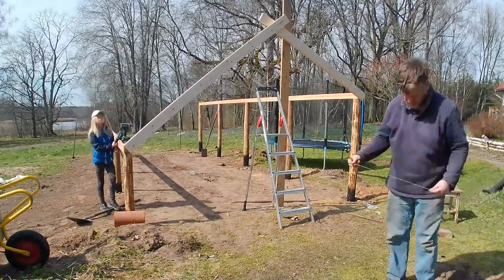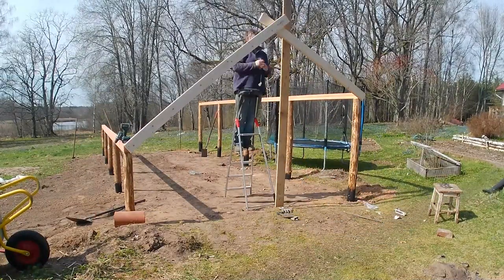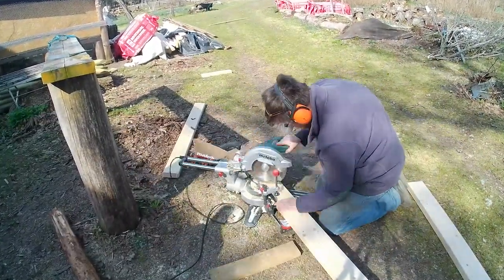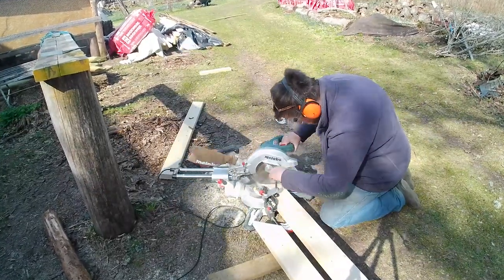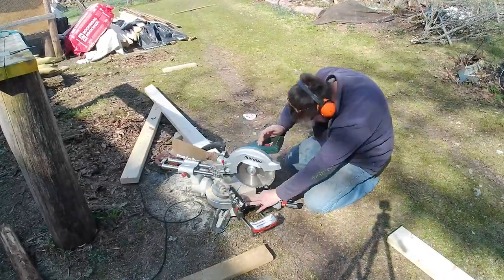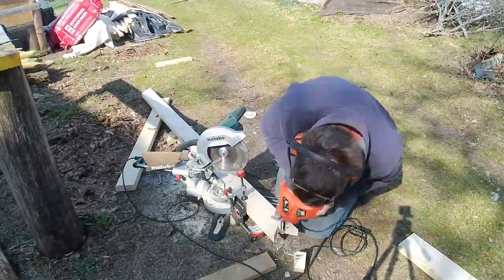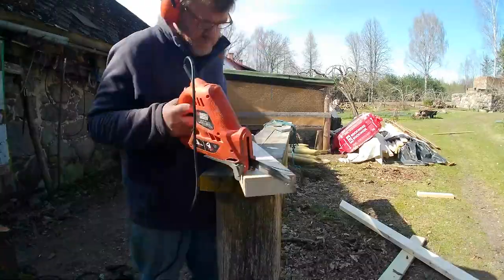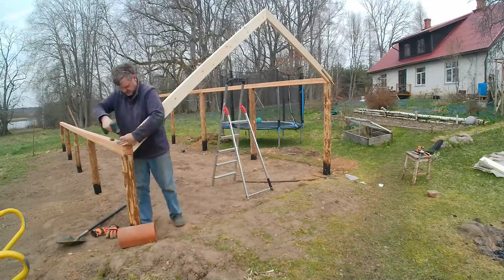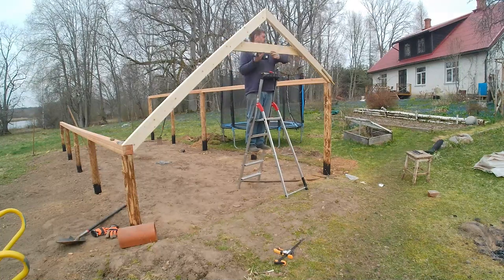I know roughly all the calculations but the best way is to set it up, nail it together, hang a plumb line so I get the exact middle and then go and cut that, which is what I'm doing here. Bearing in mind this needs to be a template, I need to get it exactly right. And then what we do is head back to fit that perfectly, works great, including the right angles for the wall plates.